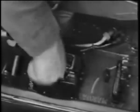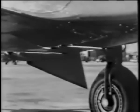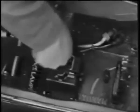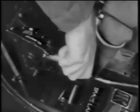On your right side are the controls for the coolant and oil shutters. Be sure they're open sufficiently. In warm weather like this, the coolant shutter should be opened all the way, while to keep the oil temperature even with the pressure zone, it need be opened only to the flush position. In colder weather, it would be almost fully closed.